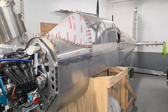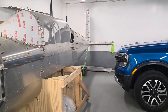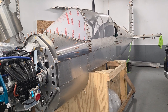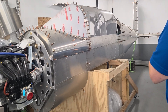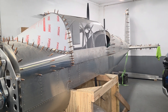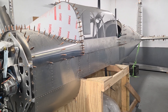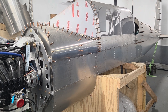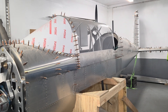It's a very large fuselage — when you're sitting in it, it should feel like you're sitting in your F-150. The reason it should feel like that is I measured an F-150, a Ford Ranger, my van, and two or three other cars we had around to get the sitting height and comfort height, and I copied that. That's why there's such a big footwell for the pilot and co-pilot — so you're not sitting with your feet out like a go-kart. I want you sitting like you're in a comfortable chair or a comfortable car. There's plenty of height for passengers. This is the first canopy — we may end up with a formed canopy later, but this is a nice simple cross-section, easy to build, with no expensive tooling required.